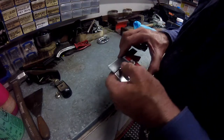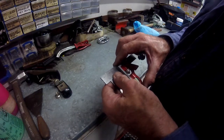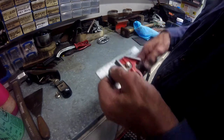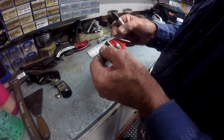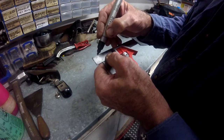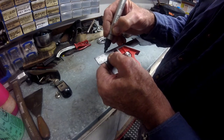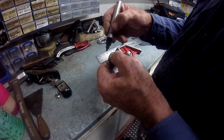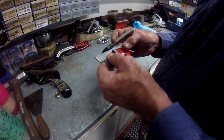The first thing I was going to do was grind away the jagged cutting edge on the blade. I did this by drawing a line across the back of the blade just under the deepest indent. Then it was over to the grinder to remove this damaged edge — just a minimal amount, just the actual indented area.